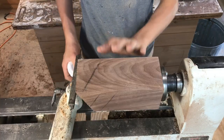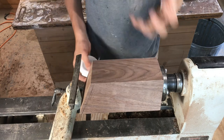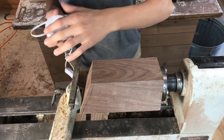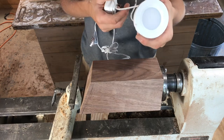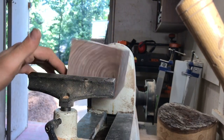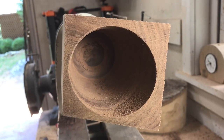I've gone ahead and put our faceplate and our wood up on the lathe. We need to hollow out a bunch of this thing so the light can shine through. The actual light I'm using is this little light that I got on Amazon — it's two and three quarters of an inch in diameter. We just have to turn a big shaft inside of this as deep as we can go without hitting the screws so the light can fit inside. The hole only has to be as big as our light. We just need our light to fit in there pretty snugly. So I've got our piece of walnut pretty much all hollowed out.